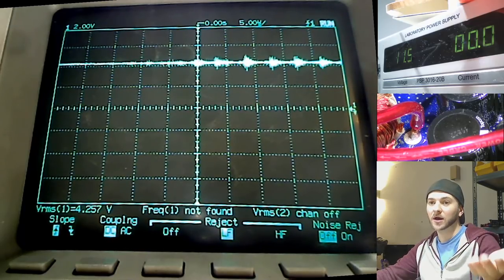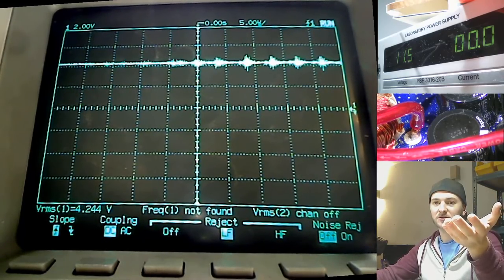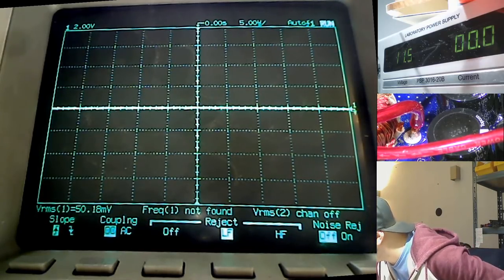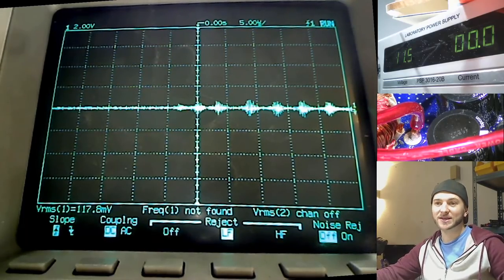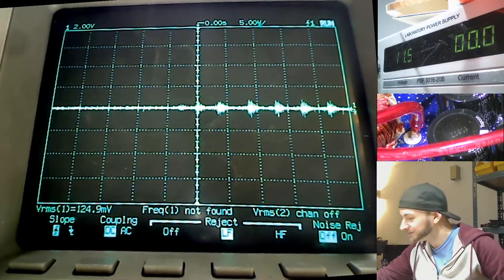So on procedure, it's in red mode, and now it goes bang on. The voltage on pin 3 drops from 5 volts, I think about 4.25 volts, to ground instantly, which turns the amplifier on. And the voltage on pin number 4, which is the dead time control, which should in an ideal world be slowly falling down rather than just being ground, doesn't move because it is ground. You see, this is just ground all the time.